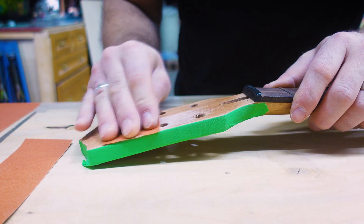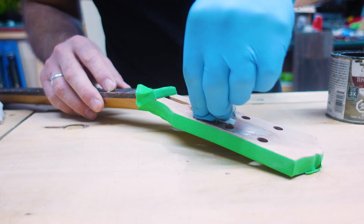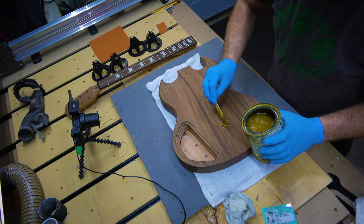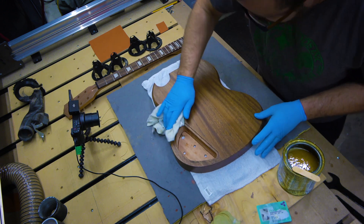The neck that we are using came pre-made, so it came with a poly finish on it already. I took some 220 grit sandpaper, sanded the clear coat off just the front of the headstock, and stained it to match the body. I could have done the entire neck, but that was way more work than it was worth for what we were going to see. Trusty old Ligna for the finish again — it's so easy to use: wipe on, wipe off, done. It is one of my favorite finishing products. We're not sponsored by them, I just really enjoy the simplicity of use. I'm typically a big fan of matte-looking finishes, and so far Ligna has yet to disappoint.